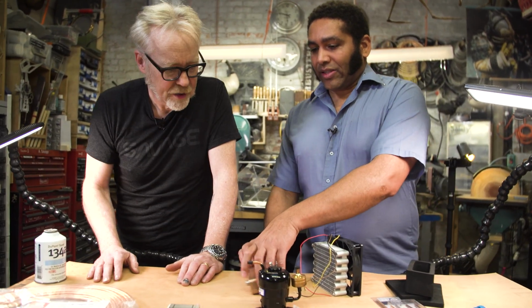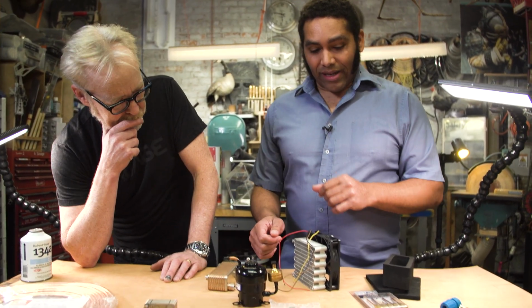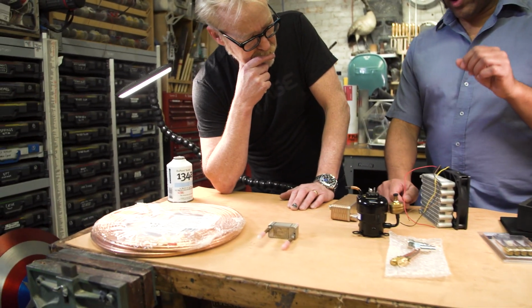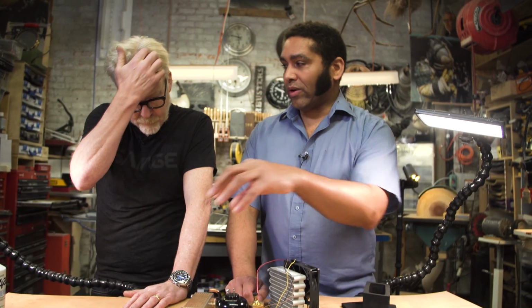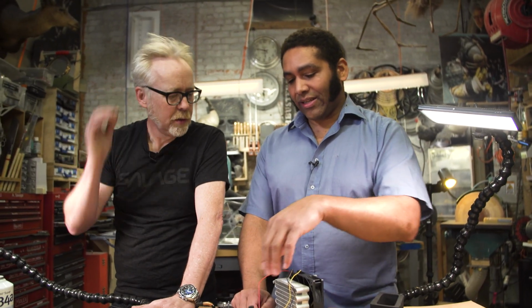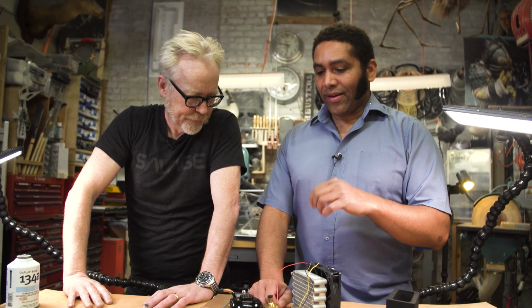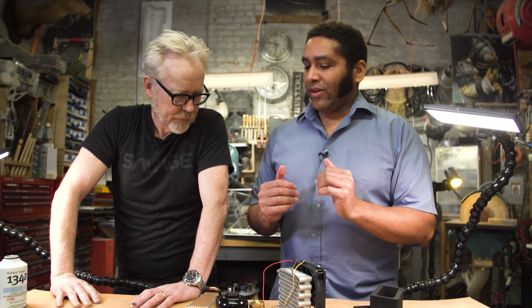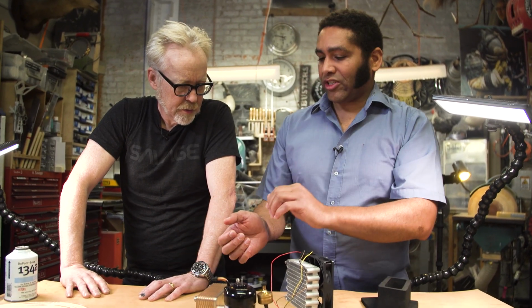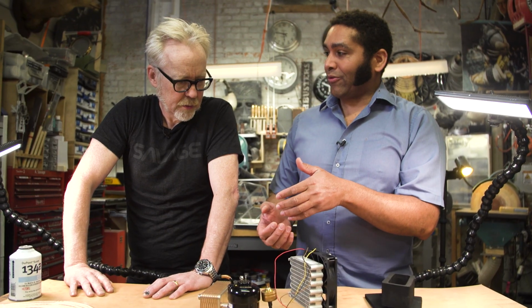This is great. So we hook these components up with some copper tube, and the one piece that's missing here: we use the compressor to put work into the system, and then we exchange heat with this first heat exchanger. Yeah. Now we have to create some way to reduce the pressure. So we keep the high pressure side high pressure. We have to drop the pressure so that the refrigerant will boil.